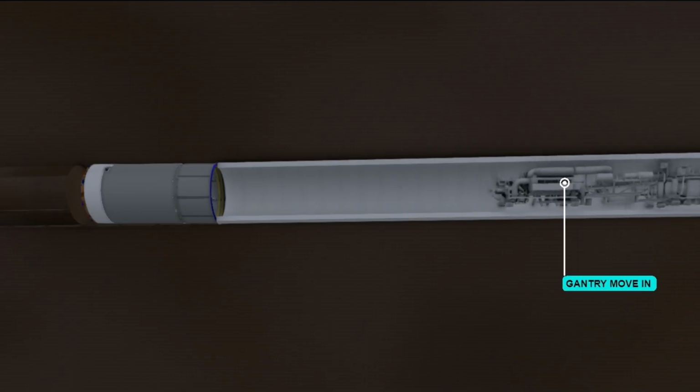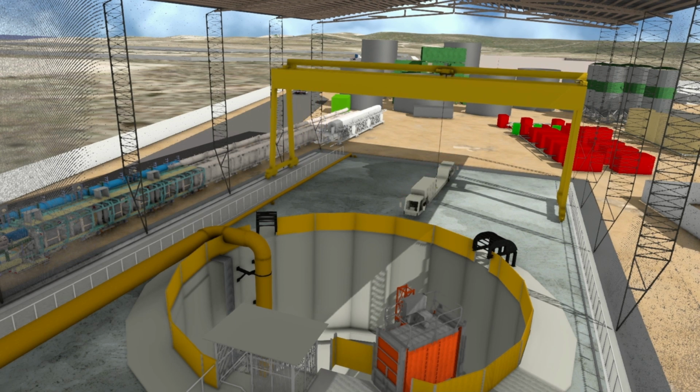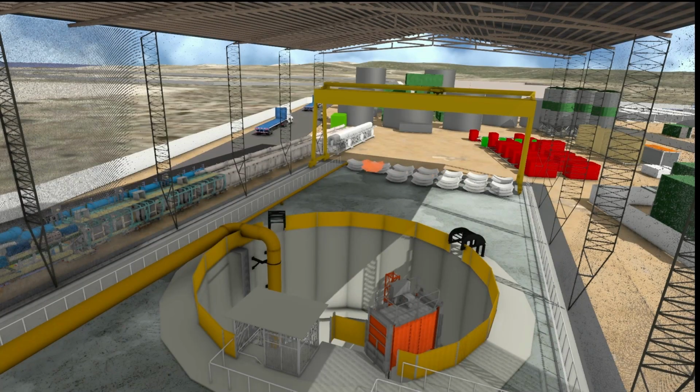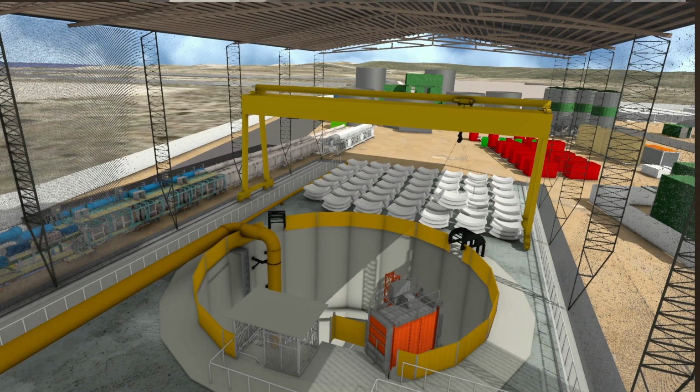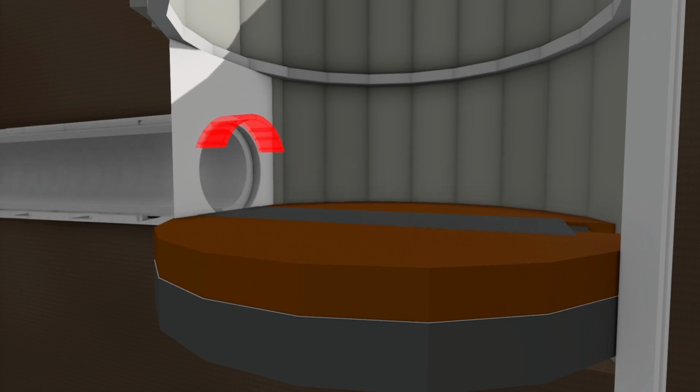The seal ring and rails are removed and multi-service vehicles can now be used for horizontal transportation of lining segments and other TBM supplies. At this stage the TBM launch is complete and the TBM commences conventional mixed shield tunneling operations, which will repeat in cycles all the way to the end of the tunnel.